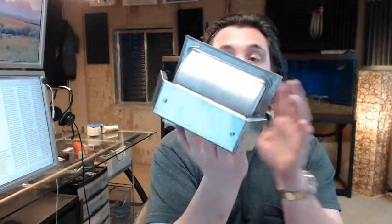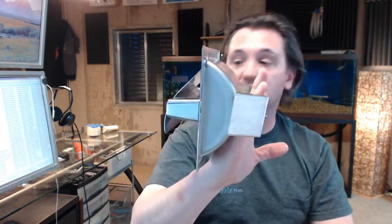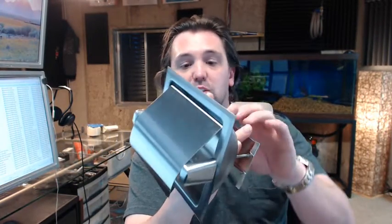Even more importantly, you're going to need to have 3 3/8 of an inch depth in order to fit all this in. So what you're really talking about is a 3 1/2 inch wood stud. That construction is a perfect alignment in terms of wall construction to get this in. And of course you'll have your 3 1/2 inch wood stud and then your 5/8 drywall or whatever the construction is, but keep that in mind. That's what this is going to be for.